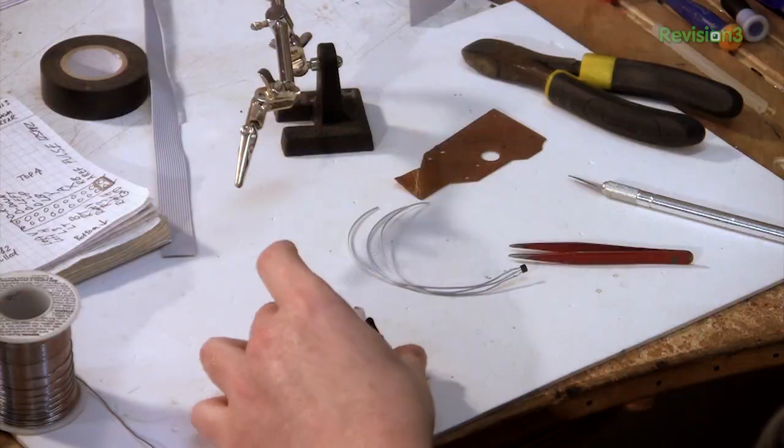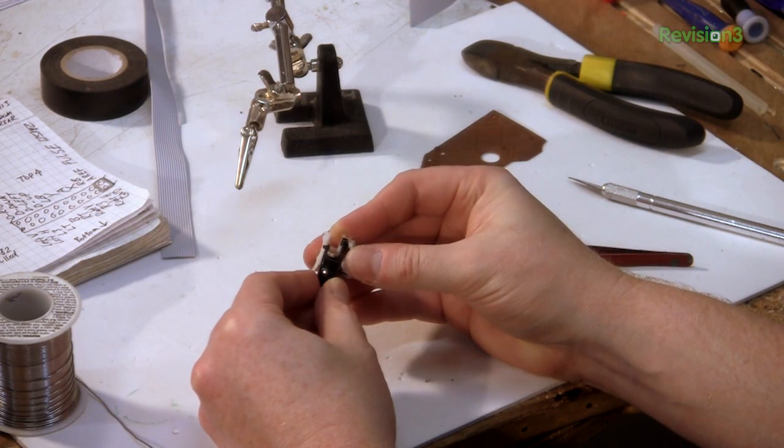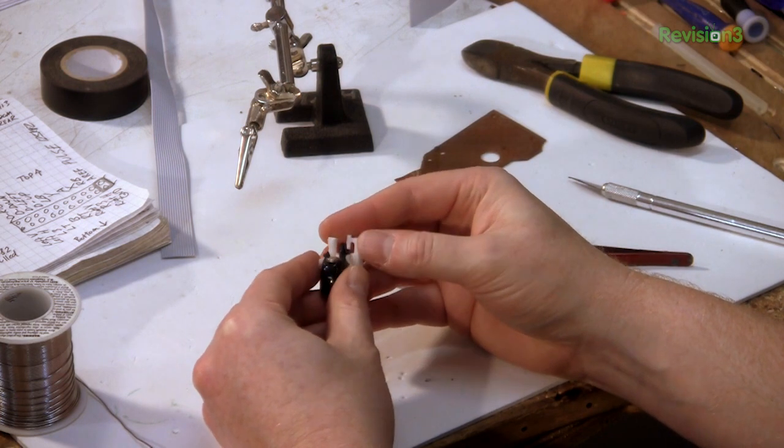I've got the extrusion assembly printing right now and I'll also have some wooden pieces that will attach to it so the plastic doesn't melt. In the meantime, I'm working on the trigger assembly. I thought about making my own trigger and then I realized it was a lot faster to use an existing one. So here's an Xbox 360 trigger, just like the one we were testing with, but I've removed the potentiometer and I just have the trigger and the spring to save space.